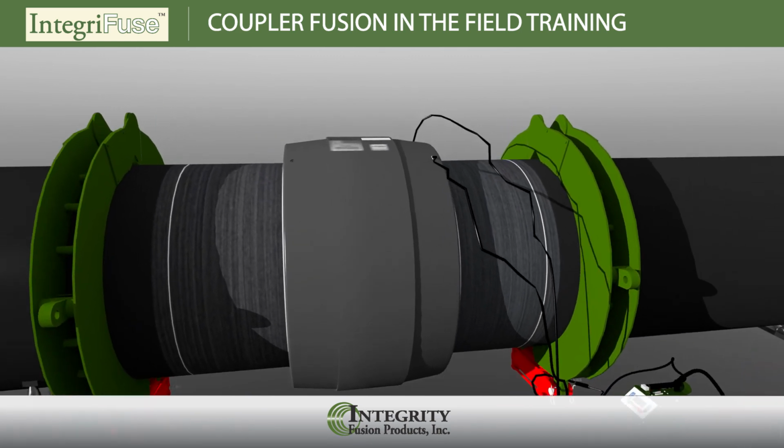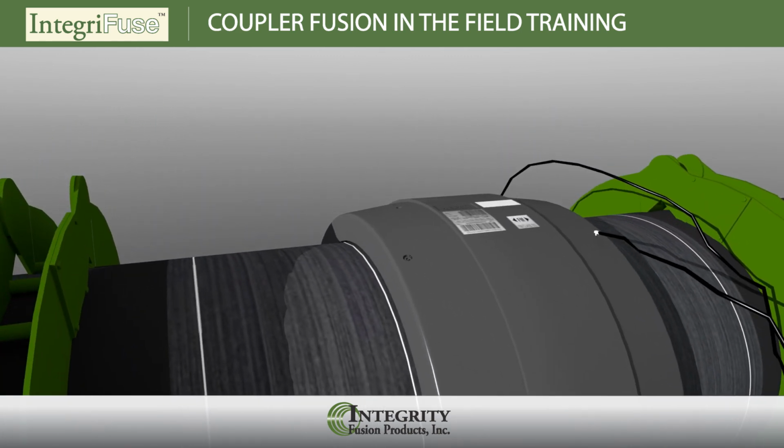For traceability purposes, we highly recommend that the installer use the approved marker to record on the pipe surface next to the fitting, the installer's initials, the time the fusion cycle completed, and the date of the install.